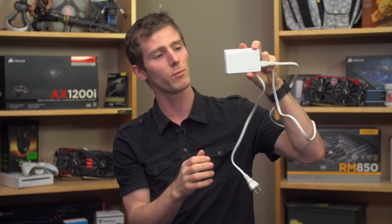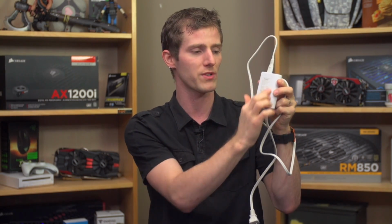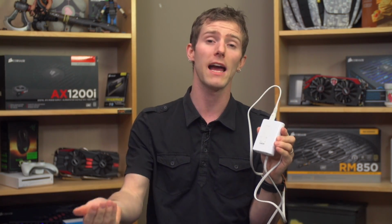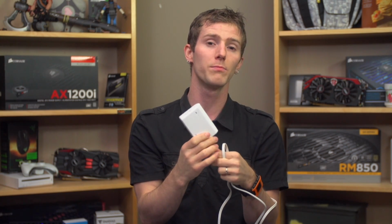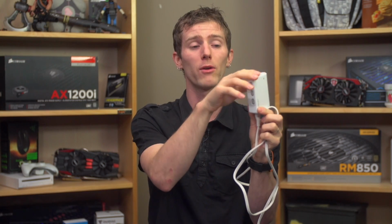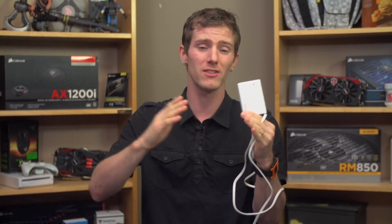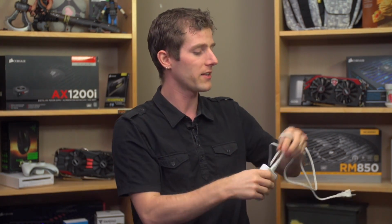The reason for going with someone like Anker for this is because all these safety certifications, over current protection, over voltage protection, all of that kind of stuff that it says it has, it'll actually have. There are lots of other cheap Asian knockoffs of products like this, but many of them either I don't necessarily trust them, I don't necessarily think they're safe, or they are not actually rated to output a decent amount of amperage on each of the ports. So you could plug a bunch of things into it, but they'd be limited to anywhere from 2 amps to 3 amps total, in spite of having a ton of USB ports.